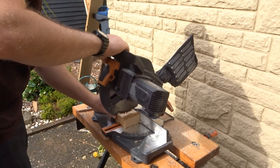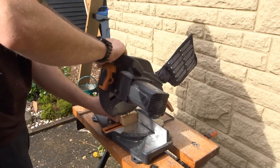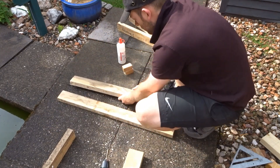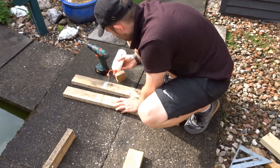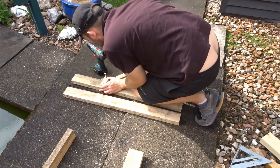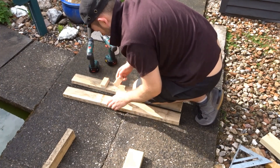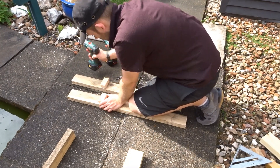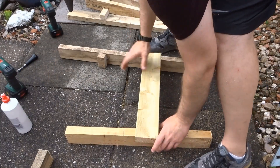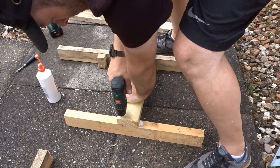Then I wanted to cut a couple of blocks which are going to support the armrests — you'll see how that works in a moment, very similar to the way I made the bench originally. Now it's time to glue and screw these two side frames together, and first I'm going to add those blocks, those supports for the armrests along the back. For the frame I piloted and screwed and glued everything together, and I used some ceramic-coated decking screws for that. To add the bottom supports I used some really long decking screws just to make sure that never moves.